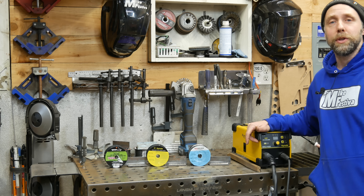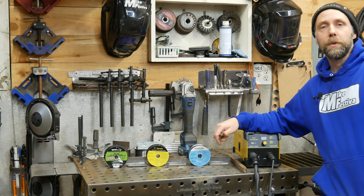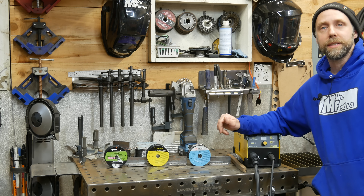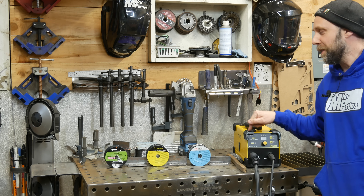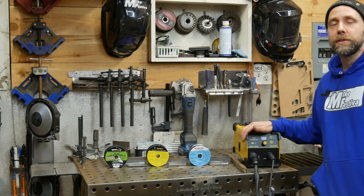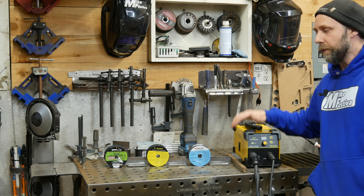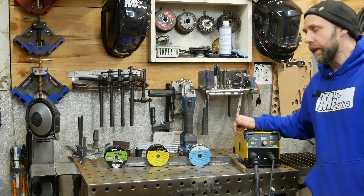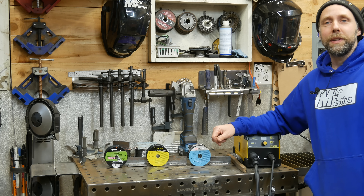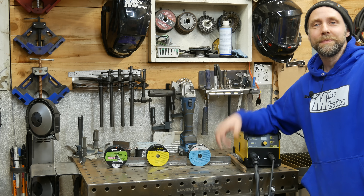This also comes down to dialing your machine precisely — getting your volts and wire speed set. This Hi-Nide 140 amp dual voltage machine is all auto-set, and all these wires were run at 110 amps all the way through — very consistent. The machine's auto-set works unbelievably well. There will be a link to this machine in the description — probably the best price going on flux welders; at the time of this video they sell for $149. Out of all the portable flux welders I've seen, this is the only one that's a dual voltage machine, so it packs a lot of value. Hope you enjoyed the video — give it a thumbs up, consider subscribing, and leave a comment below. Till next time, thanks for watching!